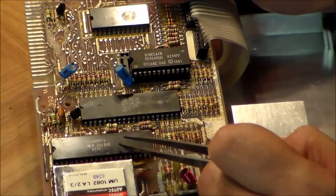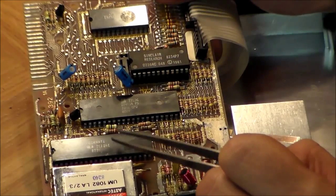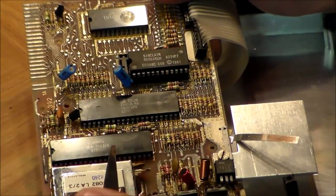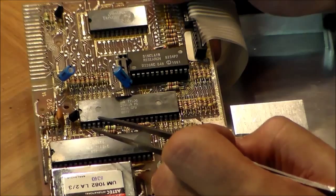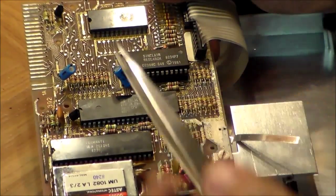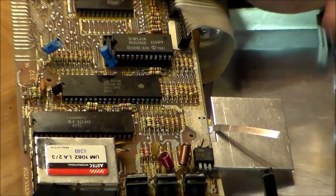The Z80 was used in many devices: the ColecoVision, many British computers, as a sound processing unit in Bally Midway arcade games, and even early versions of the Tomahawk cruise missile used one for guidance. Being popular, it was cheap — maybe a pound or fraction of a pound for Sinclair to buy. Finally, the Ferranti ULA — a glue logic chip with custom circuits that connect everything together, helping the CPU build the TV picture and read from ROM and RAM. ULAs are a more compact and at scale cheaper way of replacing many discrete resistors and capacitors. Today you'd call this an ASIC. Ferranti being a British electronics company makes this essentially a completely British machine.